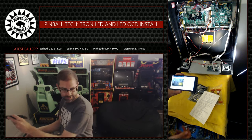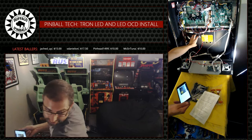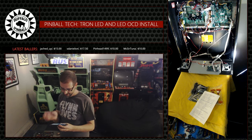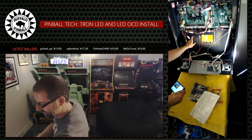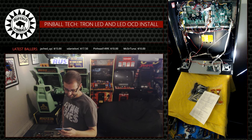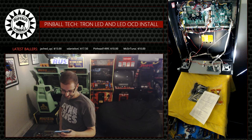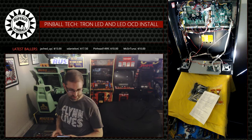It's recommending we put it in here. Since the back of the backbox is wood for the older style backbox - and this is what we have - you will normally install the board using screws. The self-retaining washers that are included can be used to hold the screw and standoff in place while installing. The newer metal backbox, however, you will use the adhesive standoffs and a different mounting position. We've got the wood, so we will use screws to install.